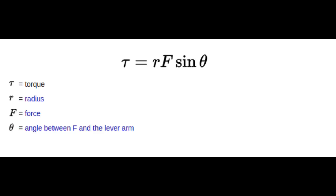Torque is calculated as τ = rF sinθ. You can plug your figures into that equation or use an online calculator that asks for the arm length (r), the force, and the angle — it will work out sinθ for you. sinθ = 0.7, force = 0.016 N, and the radius is 150 millimeters. Working that out gives us 0.0017 Newton meters of torque.